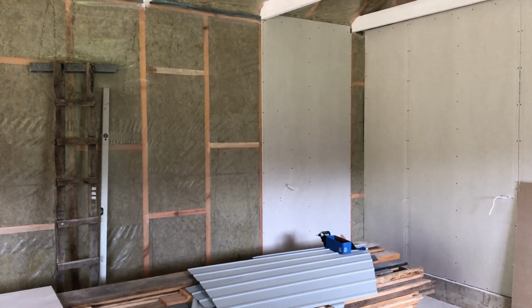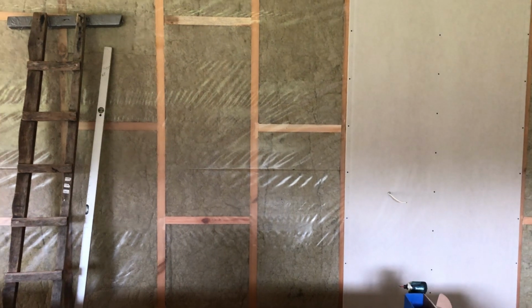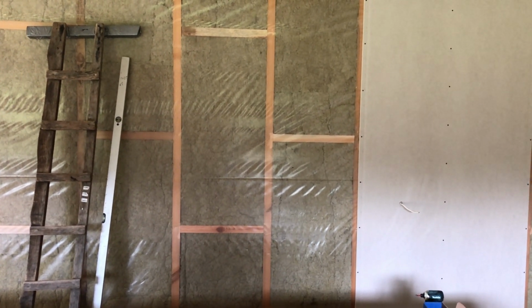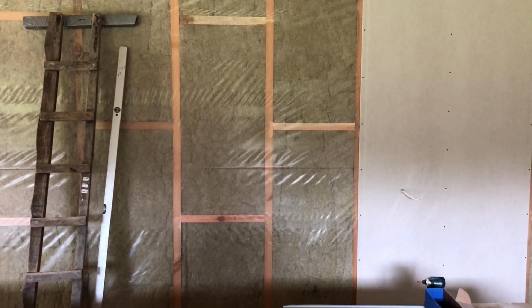With this longest wall, I had one issue. The spaces between the centers of the studs had to be 60 centimeters. But in some stage of the framing, we probably missed something or took our measurements from the edges rather than centers, not sure. But this caused some spaces not to be equal, and I had to leave some 2 to 4 millimeter gaps between the sheets.